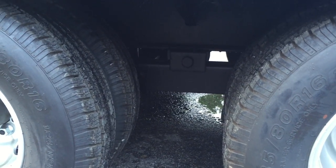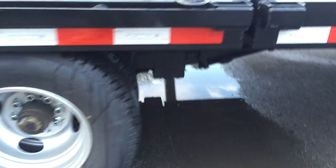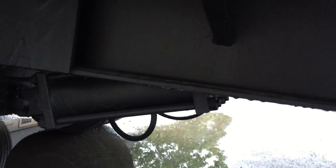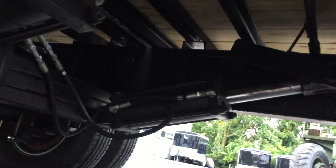Slipper spring suspension is standard. With the undercoating, everything will last a little bit longer. At the back pivot point there's a nice detail typical of ShoreTrak — they put a grease fitting on it. They also use larger cylinders than most; these are five-inch cylinders with dual cylinders on this particular unit.